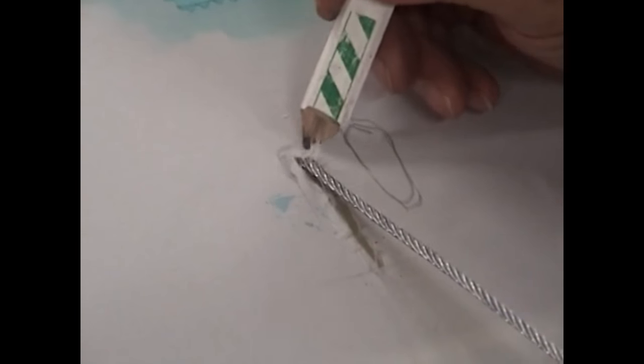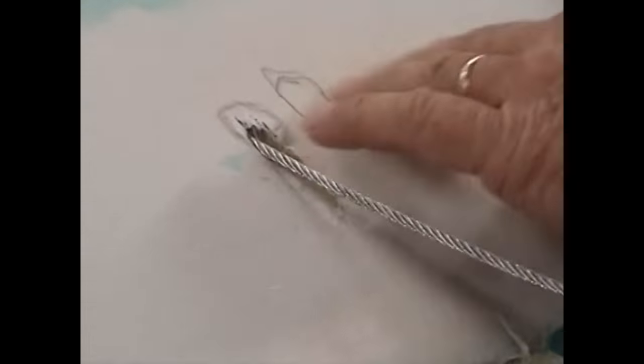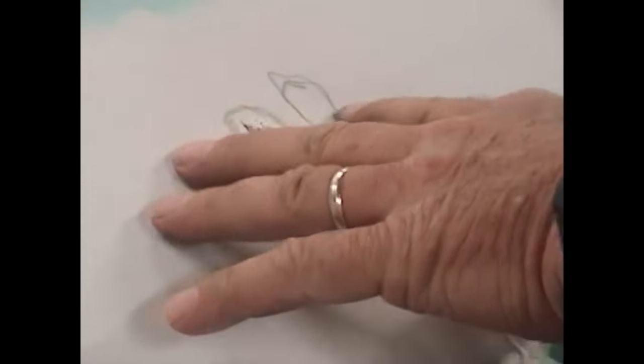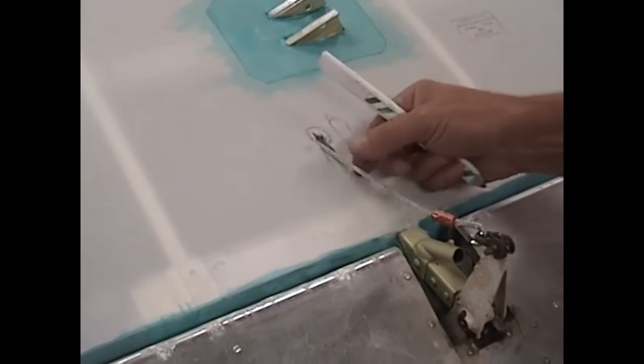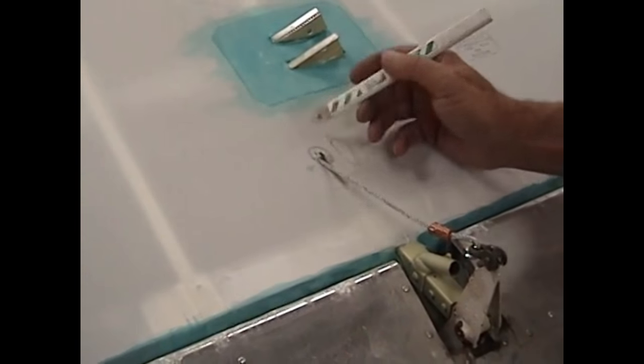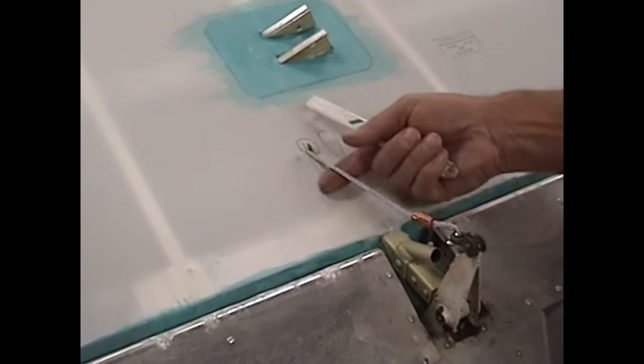I always like to set these up so they don't touch the cable at all. We're going to demonstrate a little fair lead that will go over this and cover up the open area for the cable — it makes it very easy to open this up to the point that nothing touches the cable at all, yet this area is completely sealed off. We've pretty well relieved that cable area right there. I'm going to mark with a pencil an area where I'm going to want to open this up a little larger, and then we'll go ahead and glue a patch over that to reinforce it. We'll actually bend up an aluminum fair lead to come over this and enclose the area — it makes a very nice transition instead of the old flat leather patch that doesn't do a real good job. The little aluminum fair lead is also very effective at shedding water and keeping moisture out of the wing.